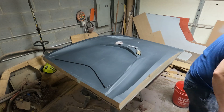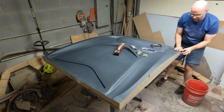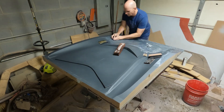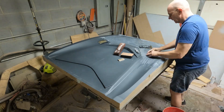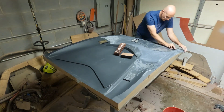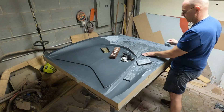While you watch me wet sand this mold, let's talk about a couple of things going on. I've had some more CNC issues. Last week when I was closing out the video, I was showing a finishing pass on the second half of the mold, and just a couple of minutes after I stopped filming the CNC started acting up again. One side had failed, causing the gantry to get out of square enough for the other side to fail as well. Once I saw it happen with my own eyes I knew exactly what was happening. What I've done is removed all the connectors and wiring from all four stepper motors and rewired it — straight wired it, bypassing the connectors — to all four steppers. Hopefully that won't be an issue in the future and all four stepper motors will perform as they should.